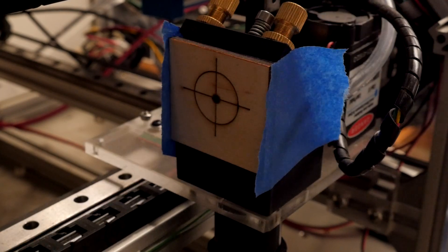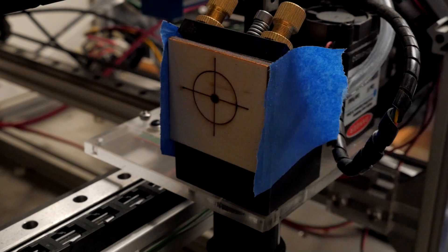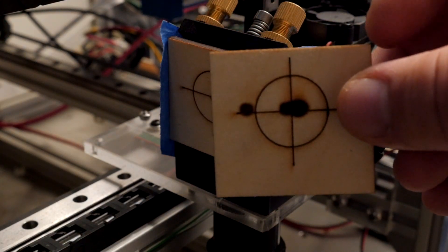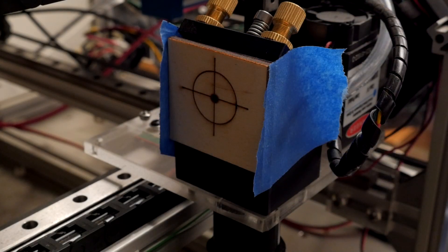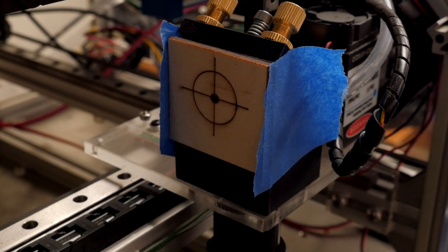So I actually cheated a little bit — you can see that this laser is pretty much dialed spot on. But if the laser was off, this is where I could turn the knobs on my kinematic mount to adjust the beam and walk the beam into the center of the aperture. Here you can see my first attempt at doing so: my laser in this case was really, really off at the beginning, and then I walked it back towards the center, did another test fire, and got it right in the center.